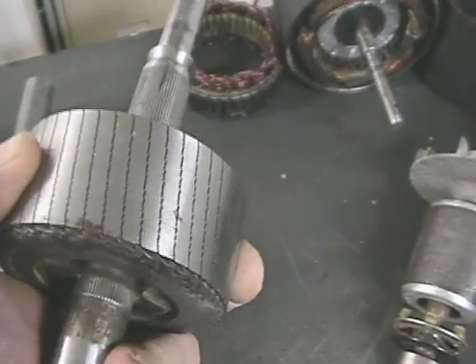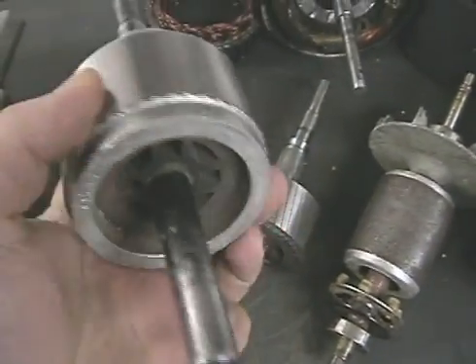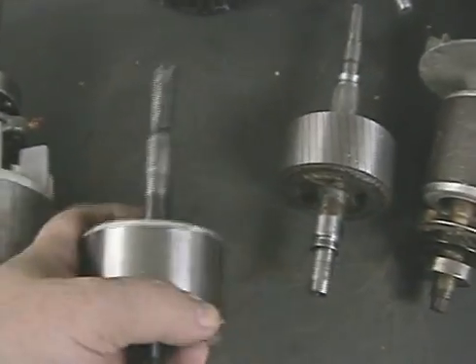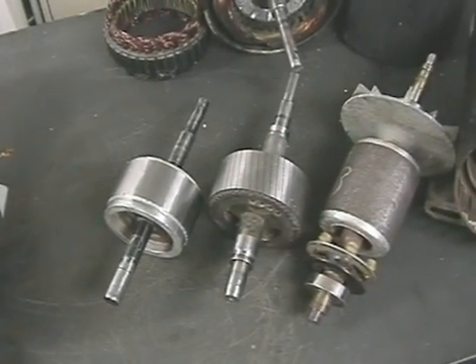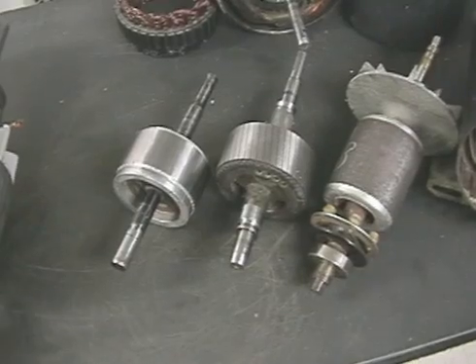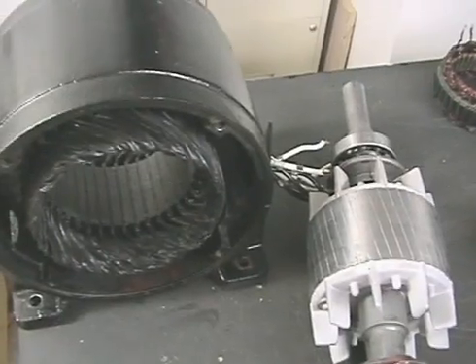I haven't come up with a timing capacitor combination that makes this work. This is a standard single-phase AC motor — although it is separated just like the three-phase — and it makes power, but only at about 1,840 RPM, which is extremely high. That's just over the rated speed of an 1,800 RPM AC motor.